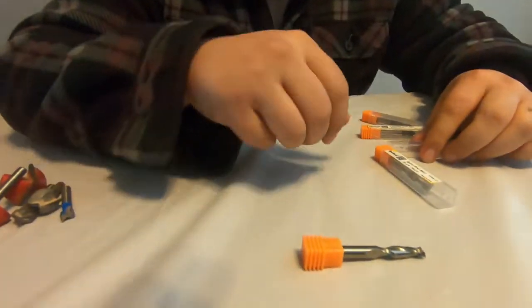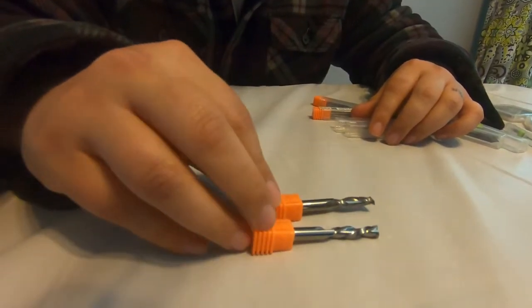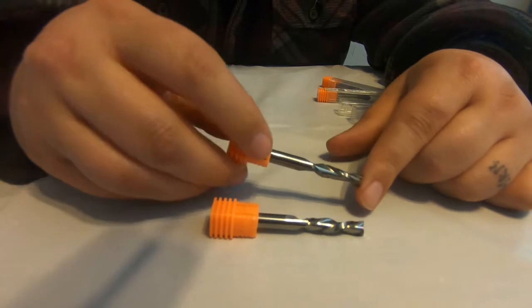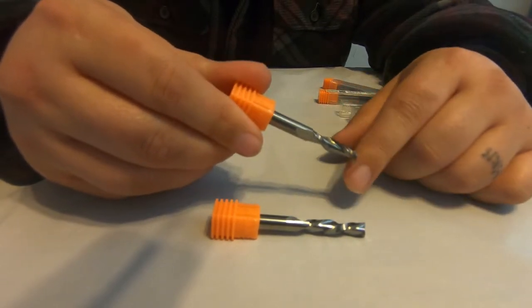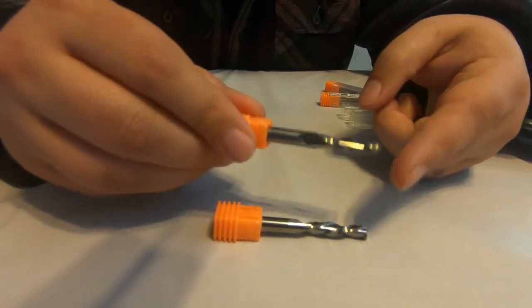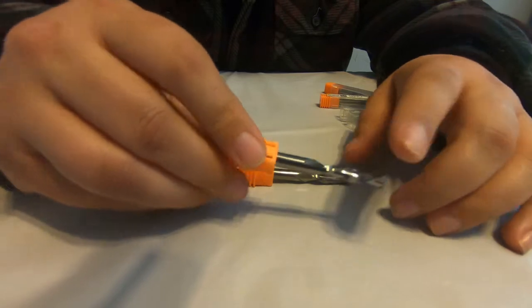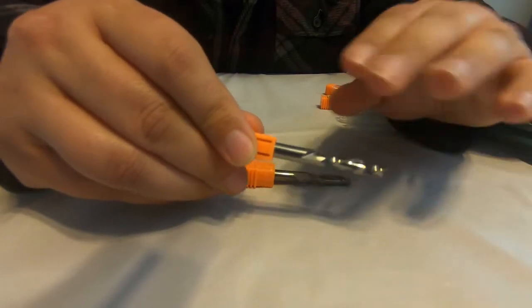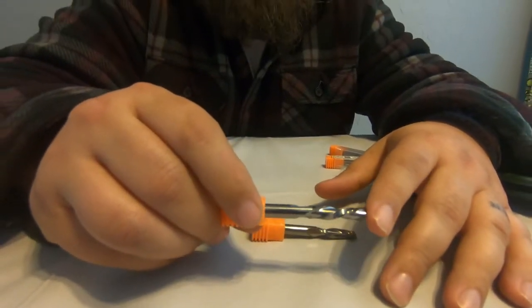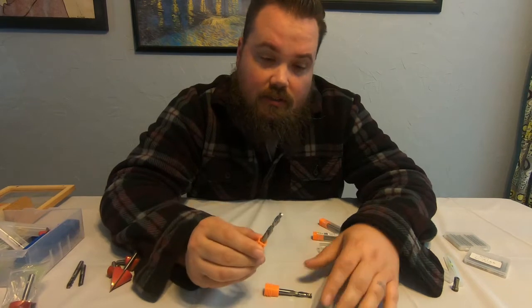I showed you the quarter inch — that is the up cut, and this is a down cut. You'll notice that they spin backwards of each other. The up cut, as it's cutting, is going to throw all your sawdust up out of the cut, making the mess we normally see. The down cut cuts downward, so it leaves a cleaner cut but packs the sawdust down. That can be a problem in hardwoods and plastics, but when you're doing MDF or plywood this leaves an incredibly smooth cut and it's an awesome bit to use.